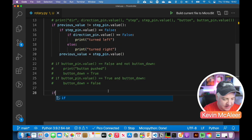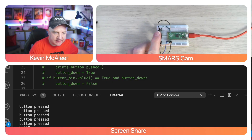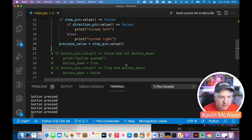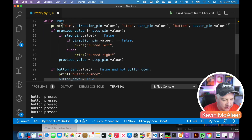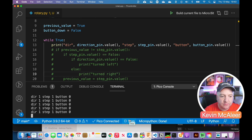Let's change our code and remove the debounce just to see what happens. I'll comment all that out and simply say: if button pin dot value equals false, then print 'button pressed.' As I press this, you can see it's printing out loads of 'button pressed' until I release — not particularly helpful. Now let's uncomment the print statement to show the raw values. When I press the button, you can see the button value changes from one to zero. If I turn the encoder, the step and direction values change from zeros to ones between the clicks. Half a movement before it clicks, the direction changes to zero, and going all the way to the click changes it back to one.